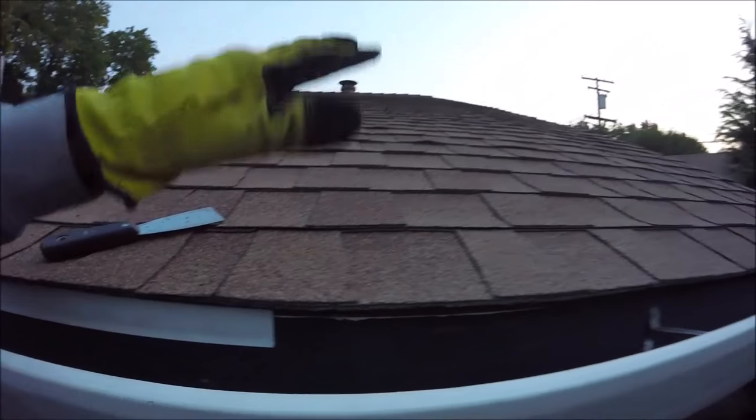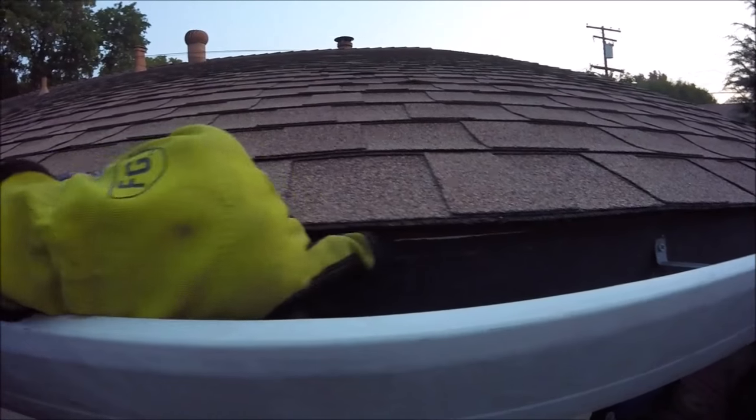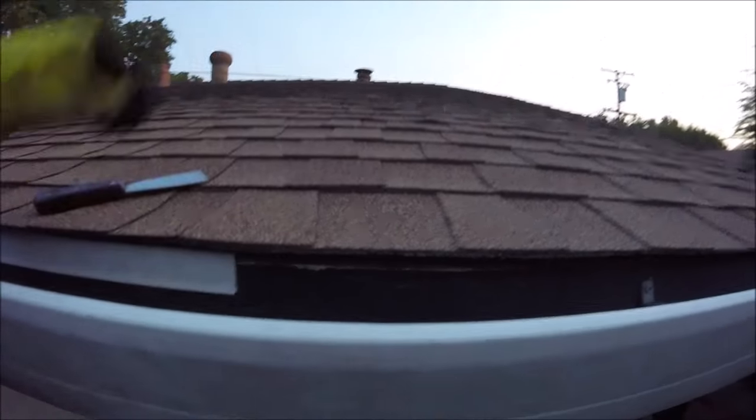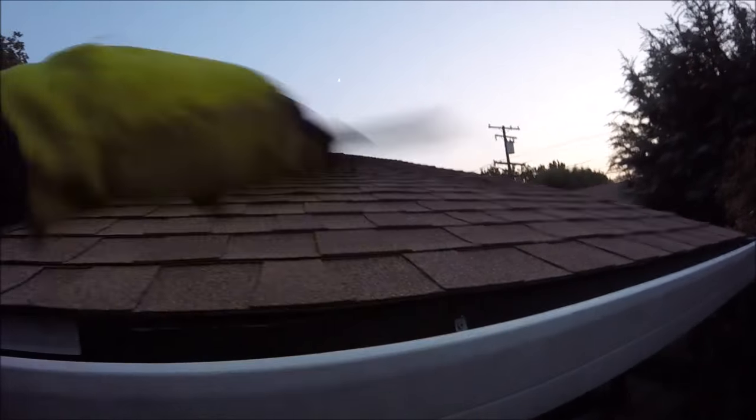None of it gets in between the fascia and the gutter. Ideally this will have been installed when you don't have any roofing on it — it goes on first on top of your sheathing, then you have your tar paper or covering, and then you have your roofing. But since we're going to be adding this to the shingles already, you're going to want to take a putty knife like this and go along and get the bottom edge of those shingles loosened up to put our flashing drip edge in.